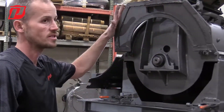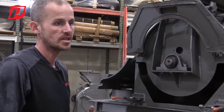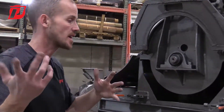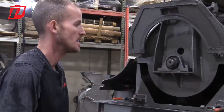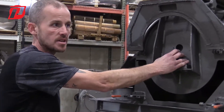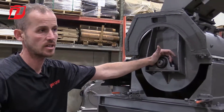Our G-style hammer mills are usually in applications where it's either gravity-fed, there's a lot of dust, a lot of nuisance dust, and a lot of stuff in the atmosphere. We have that product somehow getting inside the bearings with the grease, which we don't want. So it's a good idea to stay on a greasing schedule, making sure they have the proper grease and that you're maintaining them the way they should be — and they're going to last a very long time.